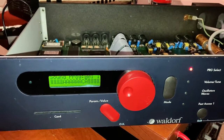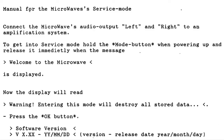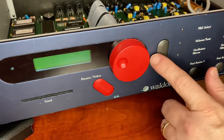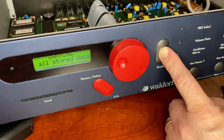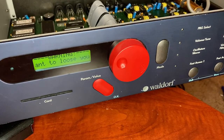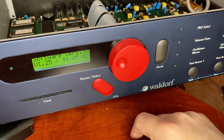So it doesn't seem to be responding to MIDI data, but I think there's a factory reset procedure I need to do. It says to get into service mode, hold the mode button when powering up and release immediately when the message 'Welcome to Microwave' is displayed. So I'm going to flip the unit off and hold down the mode button. It says 'Entering this mode will destroy all stored data.' Press the OK button. It shows the software version: 1.25.